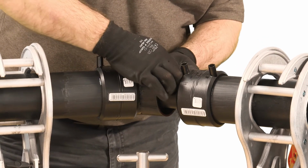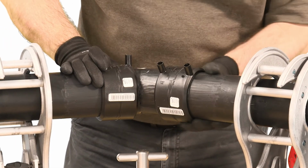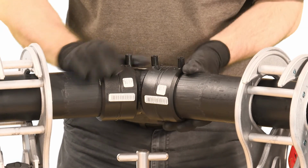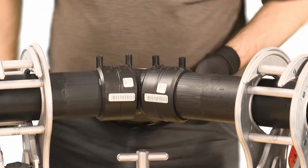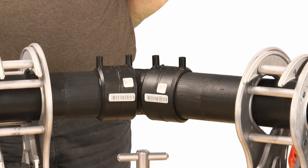After welding, remove the terminal adapters. The flying leads can then be trimmed or tucked away. If the primary fitting has terminals, remove these terminals as they serve no further purpose following the welding. This positions the secondary containment pipework correctly.